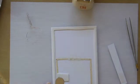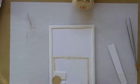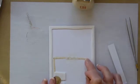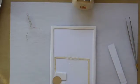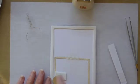The other thing you can do, if you end up with anything that is that small, is to make your circuit so that it's a complete circuit, and then to make your gaps in it afterwards. If you're using, as I'm tending to use, foil, you can just put a craft knife through it, and that will probably be enough to create the break for those tiny micro LEDs.